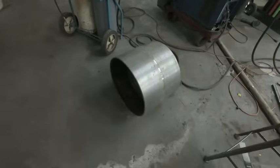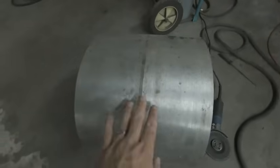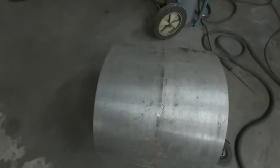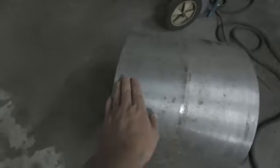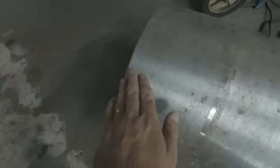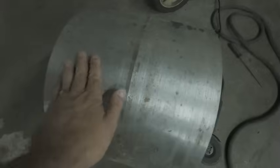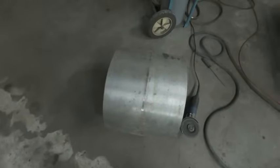I got it back here in the weld shop because I rolled it out there and test fit it on the shaft, did some measurements and changes. There it is with the taper — one degree either way — to hold the belt straight. That crown on there helps keep the belt straight. That little bit of chatter we got actually isn't going to hurt us at all; it's a little more grip. The aggressive feed gives it more grip, so overall very happy with the outcome of this pulley.